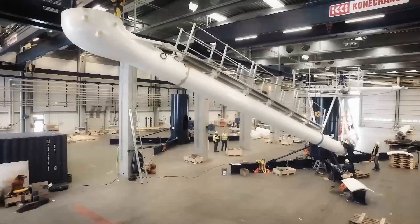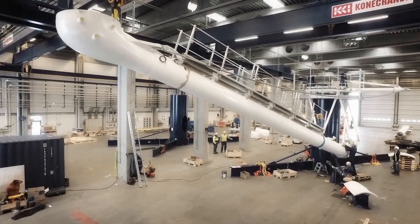The Multirotor Concept Demonstrator consists of four V29 turbines mounted on a support structure. The support structure is basically a tower with support arms. Each of the support arms can contain two V29 turbines, and each of the support arms is able to yaw individually upwind.